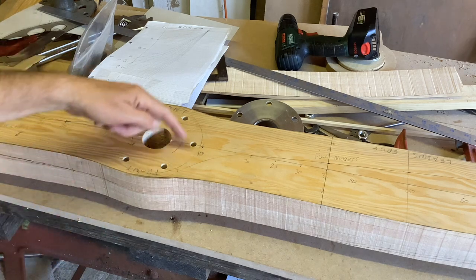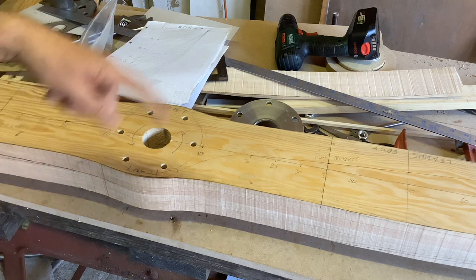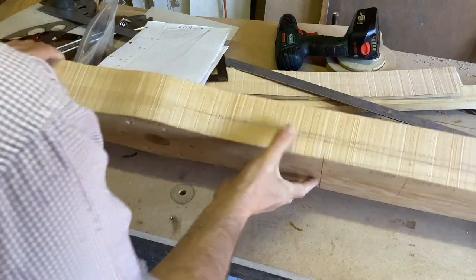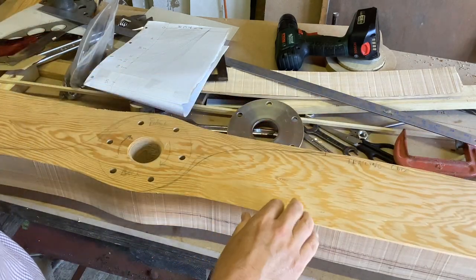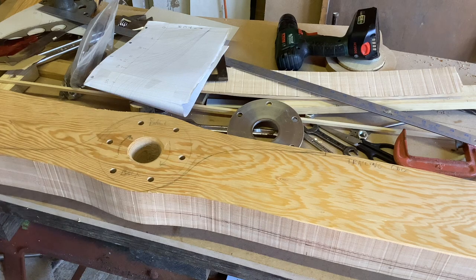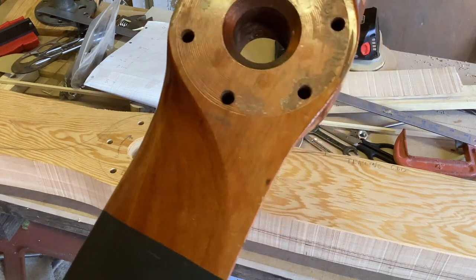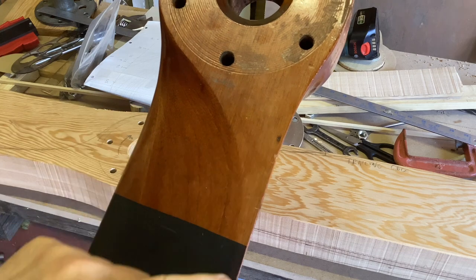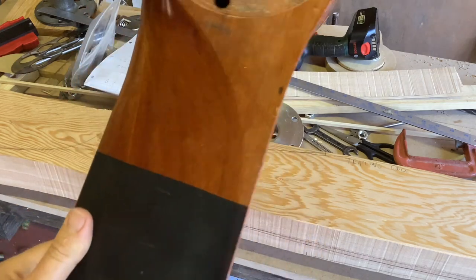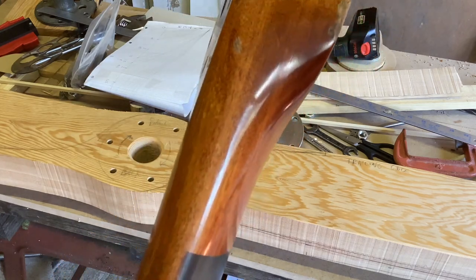The other thing I marked straight away was direction of rotation. It's a Praga engine — a copy of an Aeronca engine — so it turns anti-clockwise at the front. If you're standing behind the prop propping it like a seaplane, it turns clockwise. I keep referencing this single-bladed propeller and you can actually see the flat portion there — a little bit further up — that's where it's full width up to about 35 percent span. It's the same on the front.